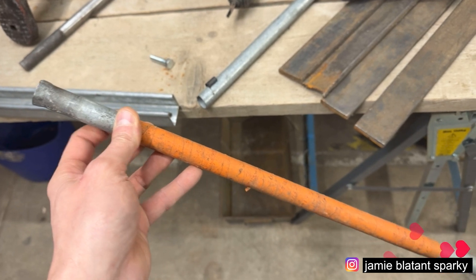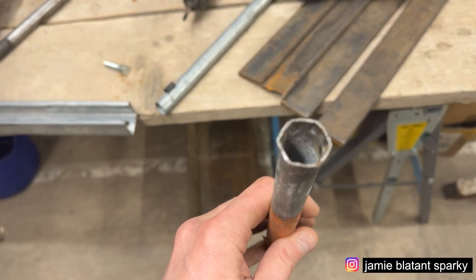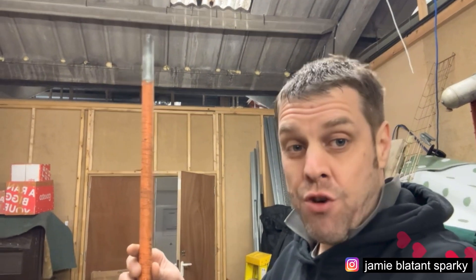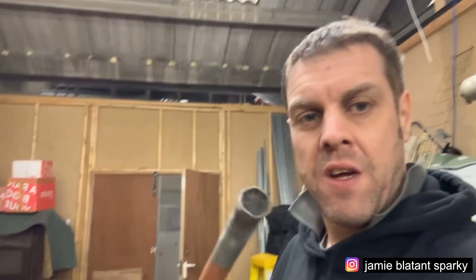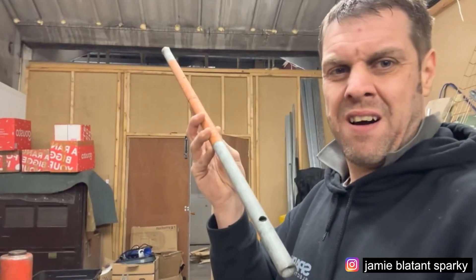When I made this I was in my early 20s, maybe even my teens. It's a proper 10mm box spanner end — a bit manked up, not a high-torque application. But if you've got to get a nut up four metres of rod, you can make a four-metre-long one and stick it on a drill to run the nut up without killing your fingers. I've also got a short one that fits in my toolbox.